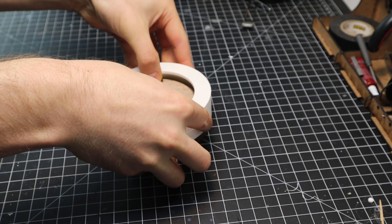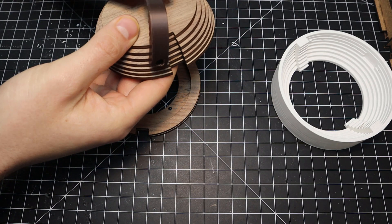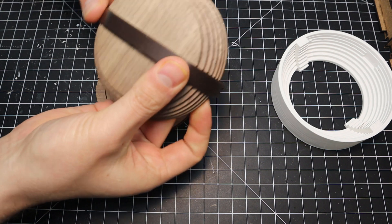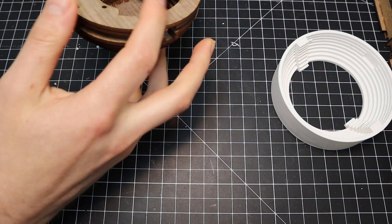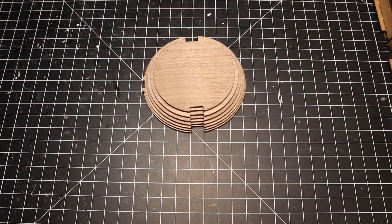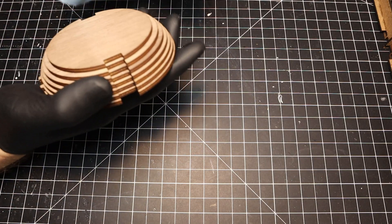The last two pieces are glued on their own. I keep these separate so that the ear cup can be opened easily. The ear cup clasp and all other 3D printed components were printed in atomic bronze metallic. It fits nice and tight on the laser cut pieces. To bring the color out of the walnut plywood, I applied Danish oil — same as used on the PC case.